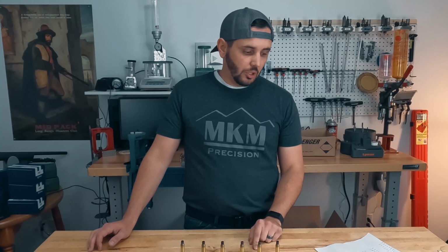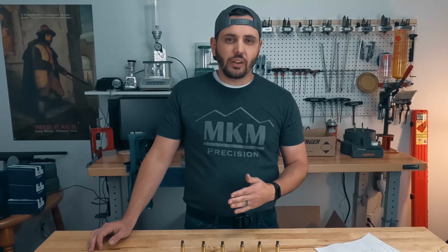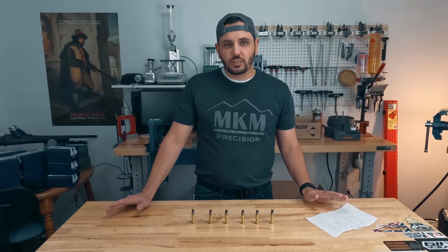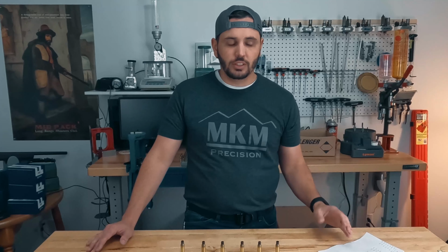From that point, we go in 100 thousandths increments. So this was 100 thousandths below that for the next measurement, and so on and so forth until you get to 500 thousandths, so a half inch below that initial shoulder measurement. All of this testing was done with micro Vickers hardness. So the values that we're going to be talking about here are hardness Vickers HV numbers.